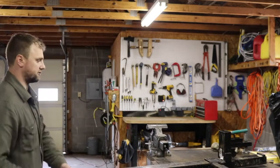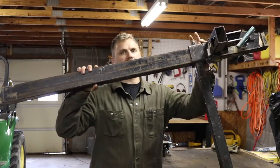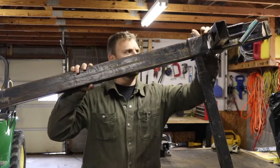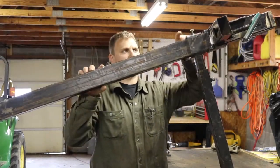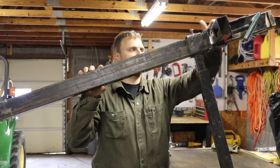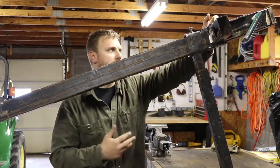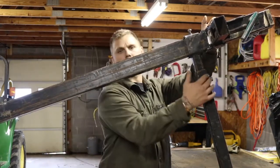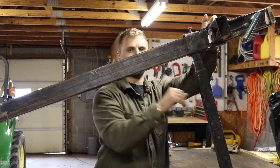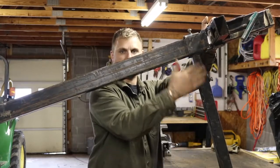One of the things on this one is we've got two adjusting screws, one on each side, and what these do is keep it from sliding in and out. You can see they don't really work well — we've actually bent this metal here using them. It's a sturdy metal, but there's a lot of force coming on the tractor when we use the forks and that bent the metal, so they don't hold in that well. These things slide out and go cock out all the time.